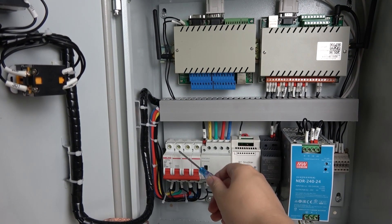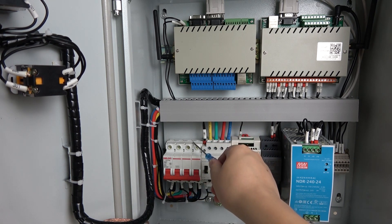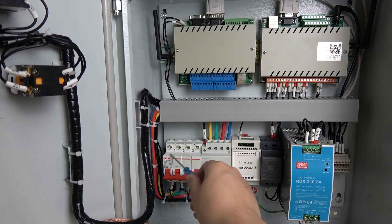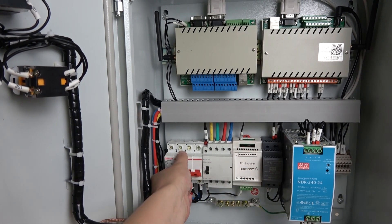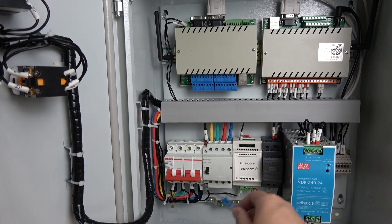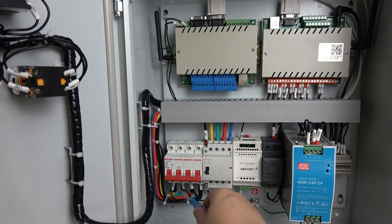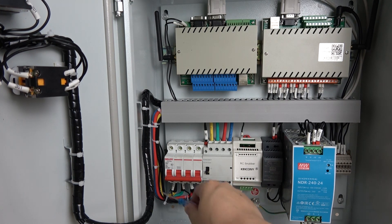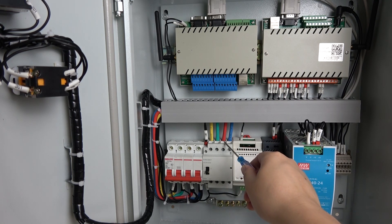So we can see how it works. The user can connect with the three-phase line — just L1, L2, L3 and the neutral input from this way. And this is for on and off for the three-phase. And this AC contactor works with AC 110 volts, so this is the output connected with the line going to this three-phase AC contactor.